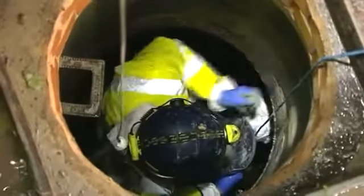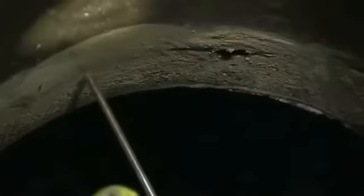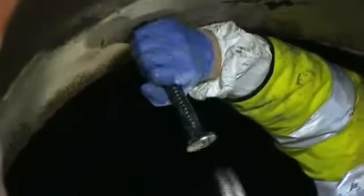The first thing Scott has to do is seal the joints between the concrete rings. For this, he's using Ergolit 10SD, a rapid set mortar which is also kneadable to plug larger holes in the substrate. Chasing down the leaks is all very hands-on, and every now and then they like to get their own back. The next job is to drill out for the injection plugs. These are located around the joint and will allow a more liquid mortar to be pumped through, backfilling any gaps in the seals between sections. Scott will work down all the rings in the same fashion, surface sealing the joints and inserting the plugs until he reaches the benching, 2.7 metres below ground.